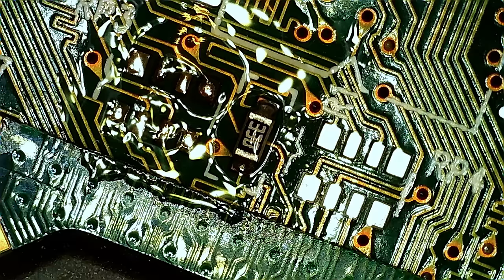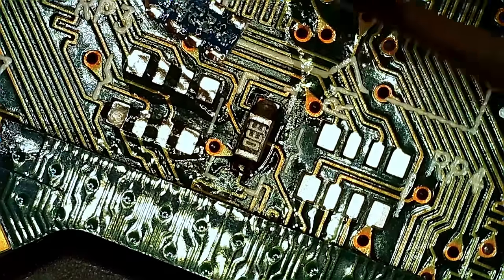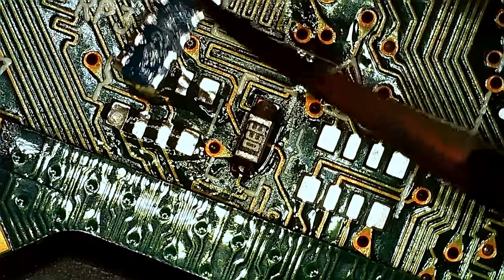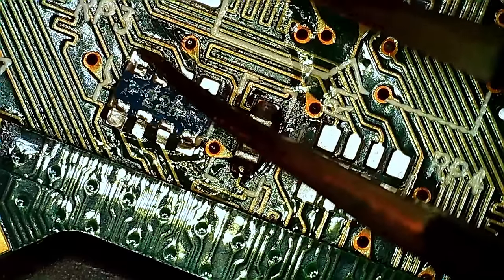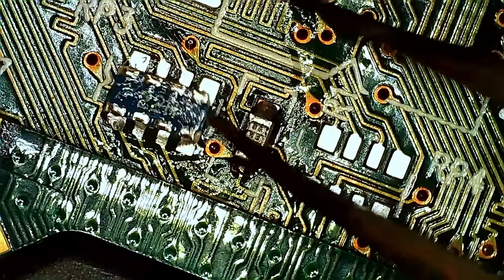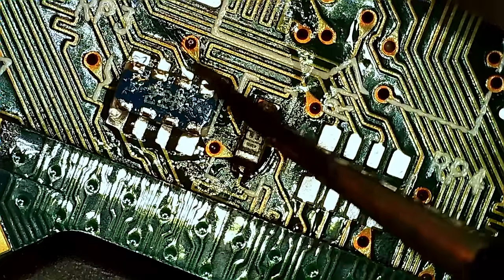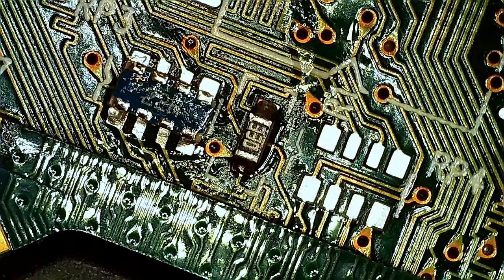The thing is, if they're shipped, they might crack, and then you have a card that doesn't work anymore. And let's make sure this one doesn't seem to have any cracks in the corners, because if anything cracks, it's corners, and it's a common problem on the Voodoo 2 that I got it off. Not in that particular occasion, but I've seen it quite a few times. It's a common problem, and usually it's around the texture unit, between the memory and texture mapping units.